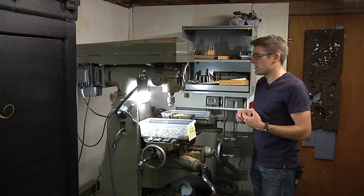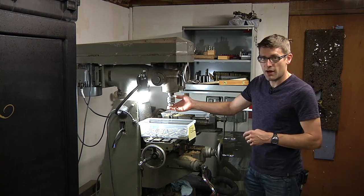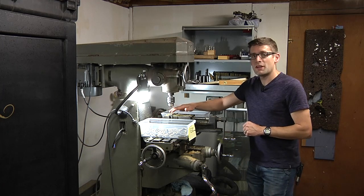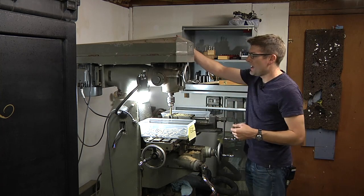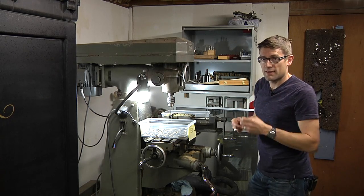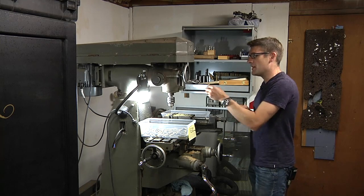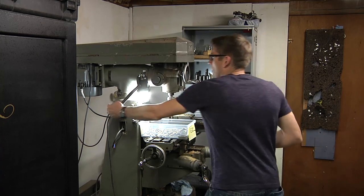This is my milling machine, which I'm going to use for case trimming. I've got a very simple setup — I've taken the case trimming cutter head off my Hornady Case Prep Center with the appropriate .30 caliber pilot so it centers nicely, and I've got a single-stage or turret shell holder in the vise. With some careful centering, I can insert a case and run it down against the depth stop to trim to exactly the right case length. The machine is set to a fairly high spindle speed because at higher speed you actually need to hold the case a little looser — lower spindle speed will grab more and want to twist the case.